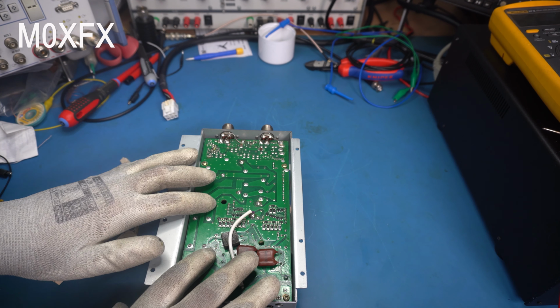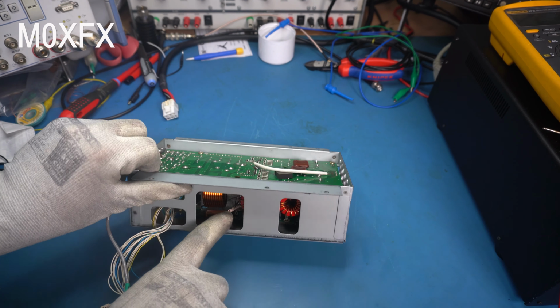So what I'm going to do is get this board out. There's another board underneath. I'm not quite sure how they marry together, but we'll figure it out. So first thing, I'm going to unsolder and unscrew these SO239 sockets from the back, and we'll see if we can get this board out. As you can see, I've got the board separated,